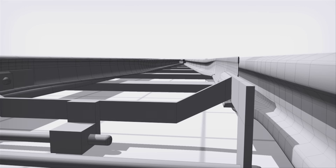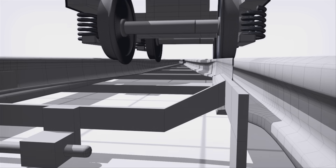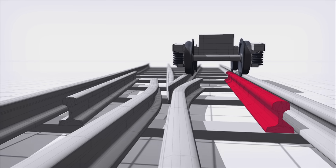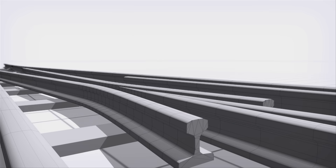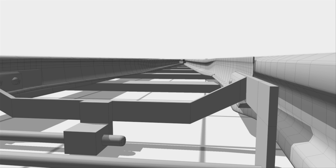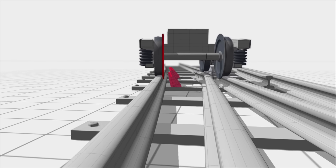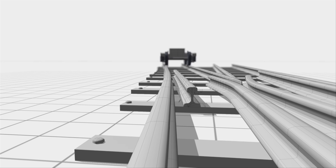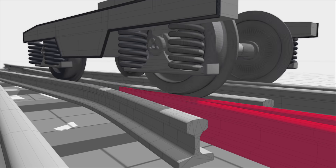In normal mode, the left-hand wheel rolls along the switch rail and there's flangeway clearance for the right wheel to continue along the stock rail. The inside surface of the right flange is kept on course by the check rail, which restrains the wheelset and ensures it is directed along the correct route. Meanwhile, the left wheel transfers contact between the different parts of the crossing — that's where there's a high impact load. In the reverse, the right wheel rolls over the switch rail and follows its geometry. The inside surface of the left flange is guided by the check rail, forcing it to follow the stock rail on the new route, and the right-hand wheel makes a crossing, again impacting a load on the crossing nose.